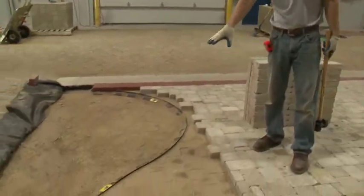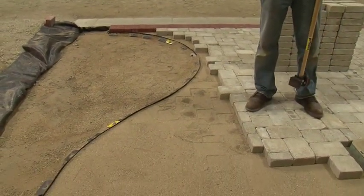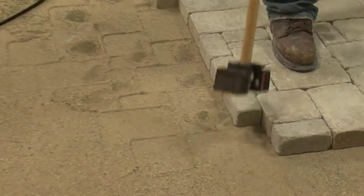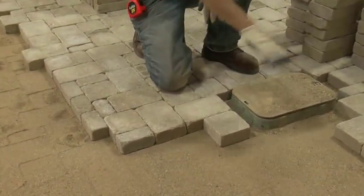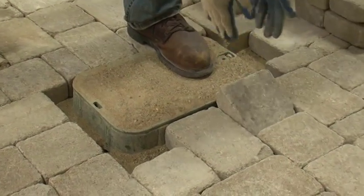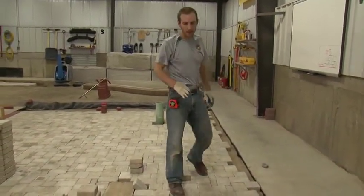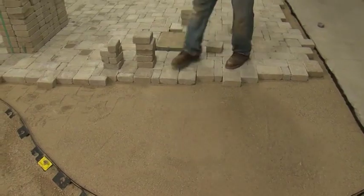In this example we went a little bit too far — we brought our laying edge a little too far out and went beyond where we have a foundation behind us. So what we did was pull up the pavers where we went beyond, tapping them just so they're snug right now, and then we're going to connect around this obstacle. We never want to bring this face out too far before this connection is made. I'm going to place this paver in the hole right here just to keep the space open so these don't close up as we finish laying the rest of our pavement. Now that we've reached all the way to the garage slab, before we go ahead and make a right angle turn into this area, we want to start a new pyramid and begin moving out straight into the new area, branching down the sides much in the same way we did on the other side.